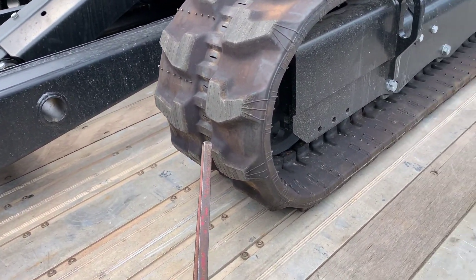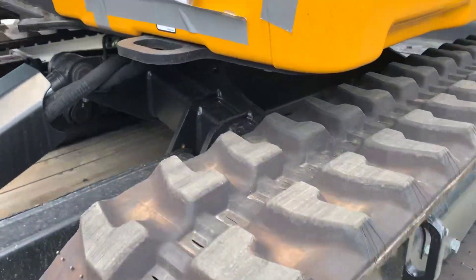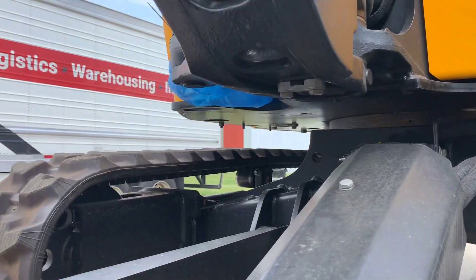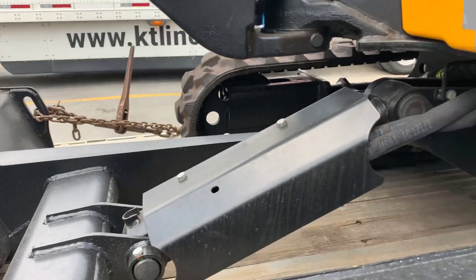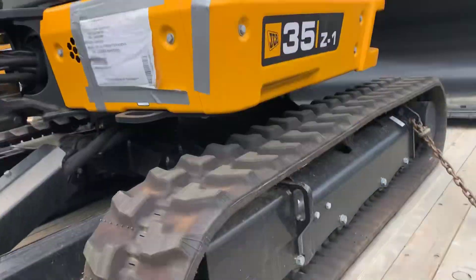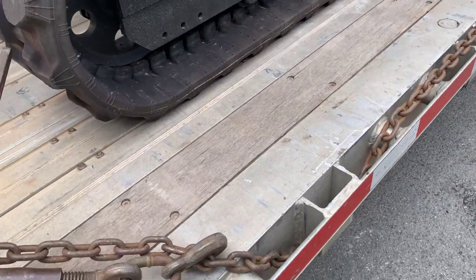These JCBs are done a little bit different here. They do have some tie-downs on each side here, and then there's one over there as well. A person can run a chain, cross it over there. But since this is just a small one, less than 10,000 pounds, it's only required to have basically two chains and two binders.